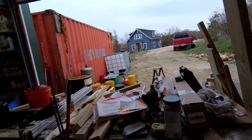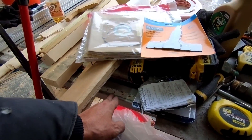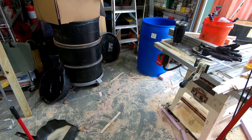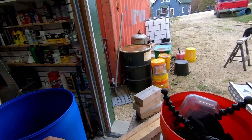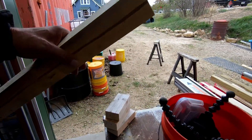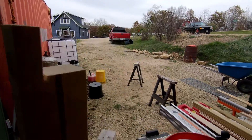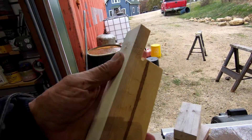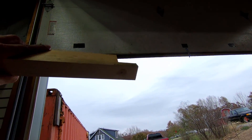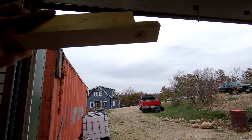But first, I've got to clear all this stuff off because I'm going to be way up here with the fence. Before that, I have to cut that stack of clamps. If you watched yesterday, this part goes in the trusses, this part presses against the foam, and this screws into the top cords of the trusses. So this will hold it up against the ceiling while the glue dries.